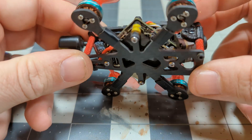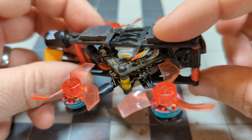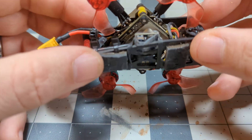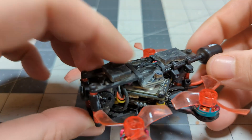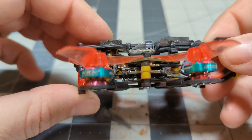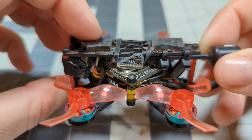To power those motors, I'm using a Darwin 15 amp AIO without built-in ELRS, because it was actually just really hard to get the built-in ELRS one. It also doesn't have a ceramic antenna on their ELRS board — instead you have to use a monopole antenna, a small dipole, or the full immortal T. So I just opted to add the iFlight ELRS 2.4 gigahertz receiver.